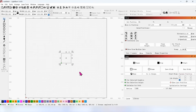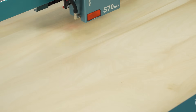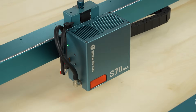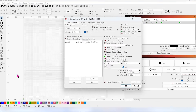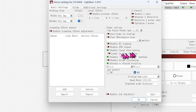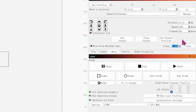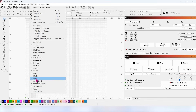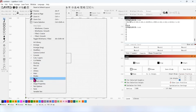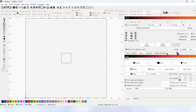After the S70 MAX is installed, the laser does not emit light when framing, making it impossible to determine the size and position of the engraving frame. Open the Edit function, select Device Settings, turn on the Enable Laser Fire button, and enable the laser on when framing. Go to the Move Window section and enter 0.1% for Fire. If the Move Window is not available, select Move from the Window drop-down menu. Enter 0.1% — when framing again, the laser emits light.